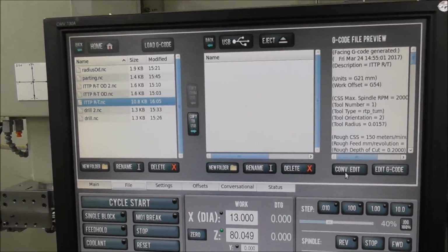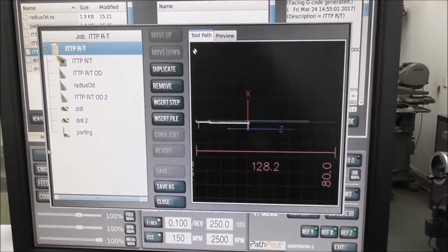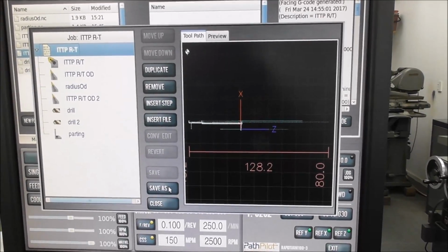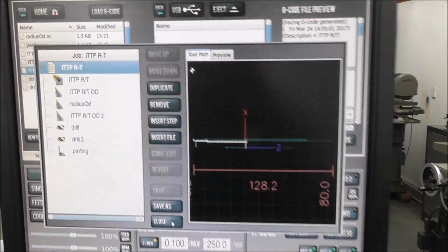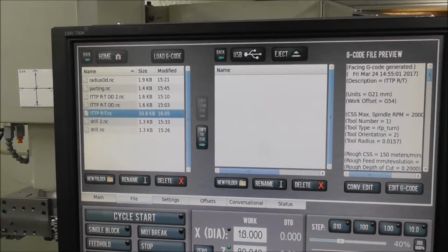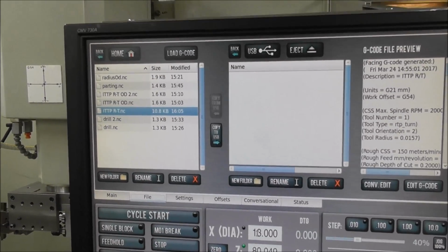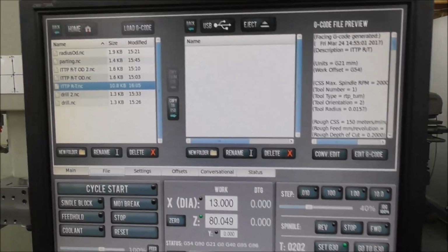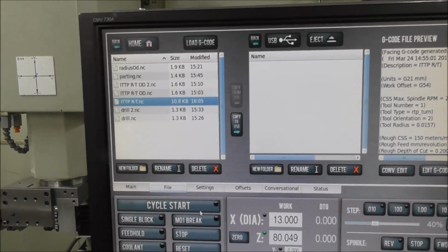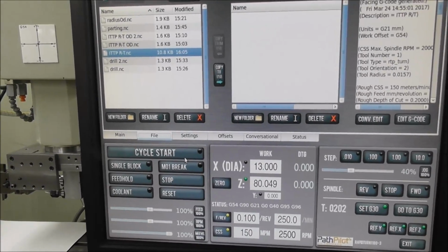And if you want to change the order of them, just go to this really neat little tool, and you can see all your files there all appended together, and you can just shift them up and down until you're happy with the order of them. And each time you're running it with one more file, so you might end up with 6 files or 8 files, and once you've tested them all one at a time and you're happy with them all, you can then run it all with your maximum velocity slider down when you start getting near the chuck, or when you start rapid traversing between tools. And it's not that difficult, and it's heaps of fun, guys.